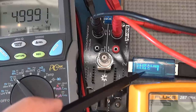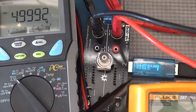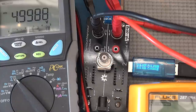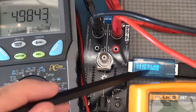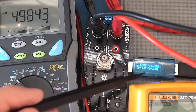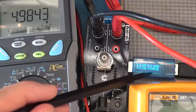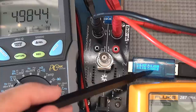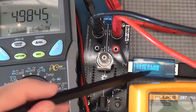You'll note the capacity setting is blinking, so I'm going to dial up the current to demonstrate that. At 100 milliamp you can see it's gone steady — because it saw at least one milliamp-hour pass through it, it's gone and reset and is now totaling up a new reading. That's how that operation works as I described it.